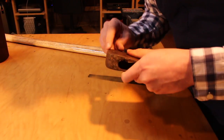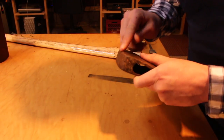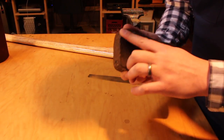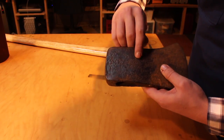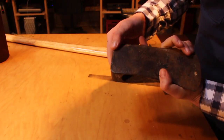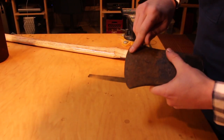As you'll notice, here on the edges it's got a little bit of mushrooming. Axes are not designed to hammer on the back — it's not hardened metal — so we'll reprofile this a little bit. It's also got some pitting. We're not going to worry about taking away all the pitting, but we will shine it up and make it look nice. And then lastly, I'll show you how to reprofile the blade and get it razor sharp.